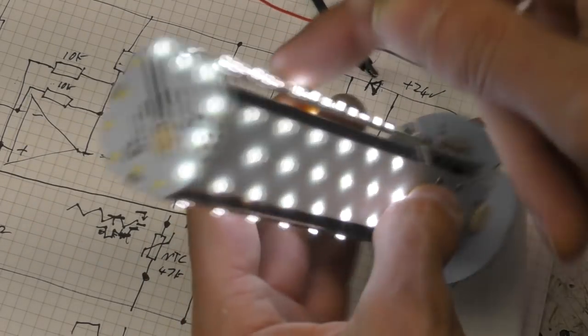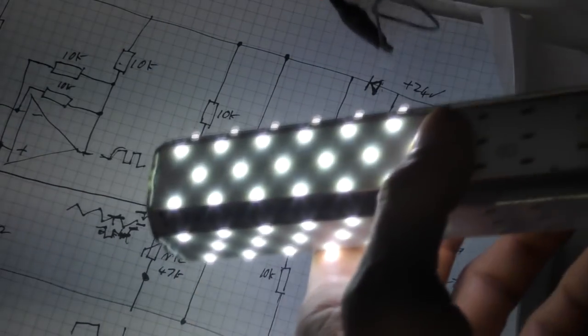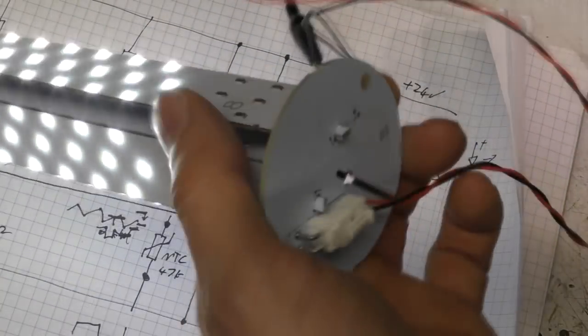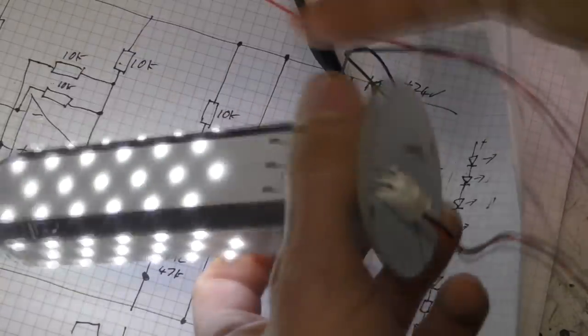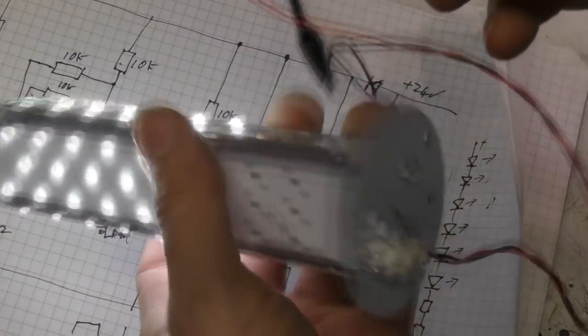We specified a lower voltage just because if you power this at full voltage, you start needing a welding mask, it's ridiculous. So we said, okay, test it at like 18 volts or something, just for comfort more than anything else. And at this stage, all you're testing is the fact that everything is soldered properly. So that immediately says that all the LEDs are working.